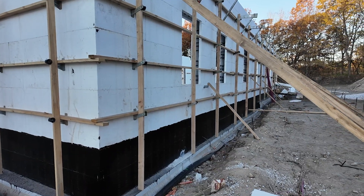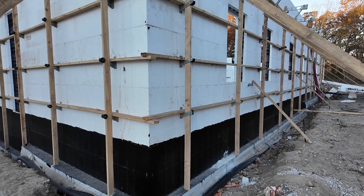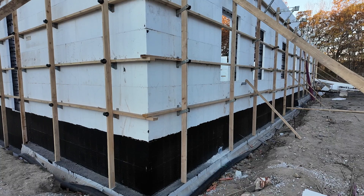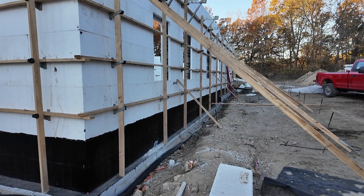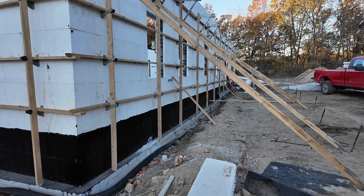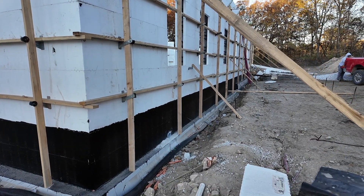Let me tell you something about brick ledge block — I'm usually not a fan of it in the Ozarks because our ground is so undulating and rolling that when you have to step it down 16 inches at a time, it generally doesn't work out very well. I probably could have gotten away with using it on this house because the entire front will be graded at one level. But I didn't, so now we've got to put in four-inch cinder block after the fact.